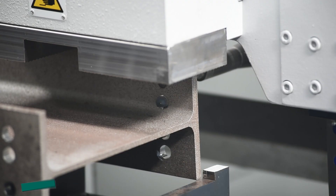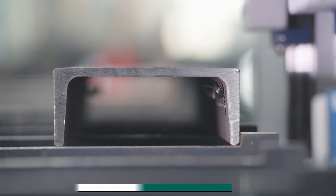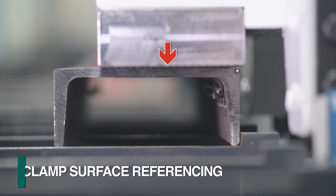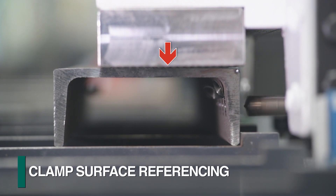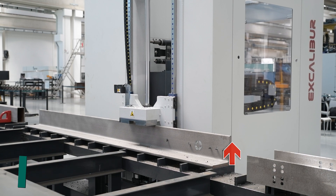The Excalibur can use three different zero locations when establishing the gauge line location in diverse sections. The surface of the material clamp can be used as a zero reference point. The table surface can also be used as an alternative when processing angles.